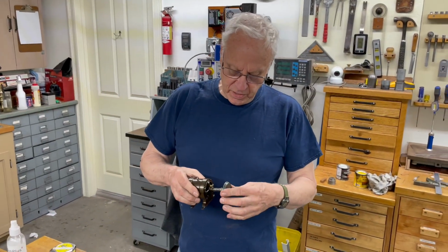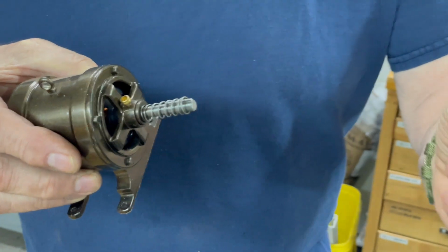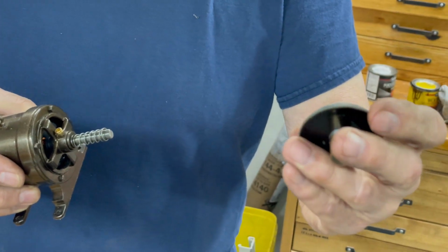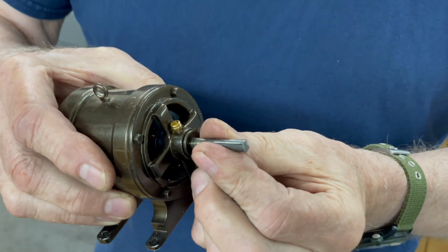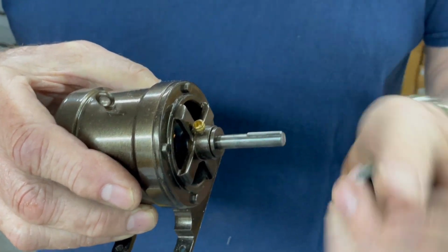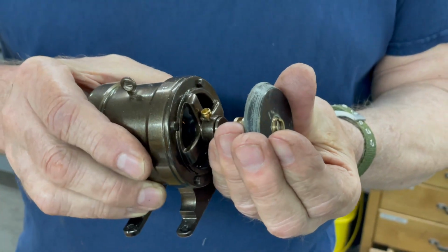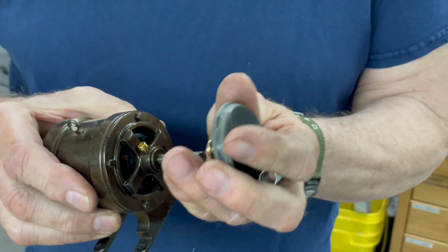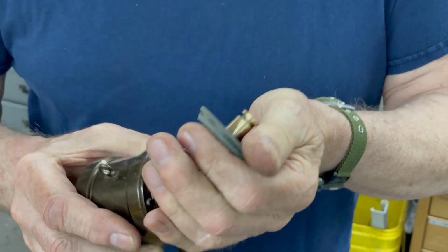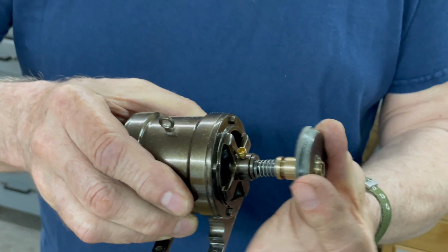Okay. I've taken the other generator off of the engine so you can see the clutch. And it's just a piece of phenolic with like a 30-degree angle on it here. Actually, I'll measure that and I'll say. And it has a shaft that's hooked to that little generator inside, and it has a keyway, so it can slide back and forth. It only has to move probably 30 thousandths of an inch to disengage it. And it has a spring on it to create the pressure when it's released. So it's holding it in there all the time.